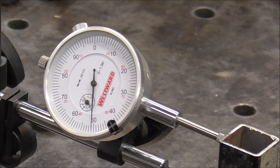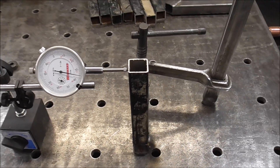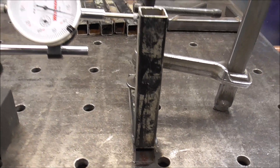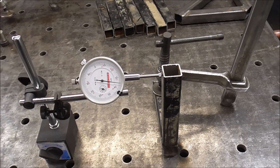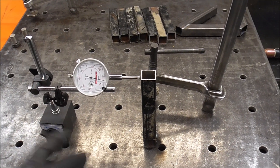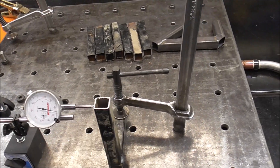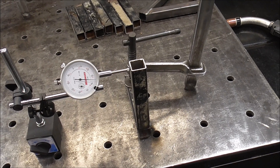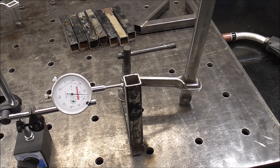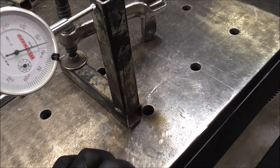Look at that gauge creep - check how that's pulling it over. It's continuing to pull as it's cooling down. That pulled it sixty-five thousandths of an inch, which may not seem like much and to the naked eye you really don't notice it, but it's obviously not perfect anymore. The problem is, if you don't correct these things, you get sixty-five thousandths here, then another sixty-five, and another - before you know it you've made five, six, or seven welds and now you're a quarter inch or a half inch out. It all accumulates.